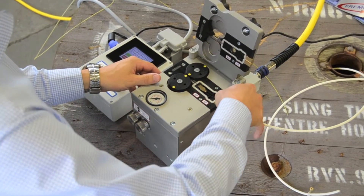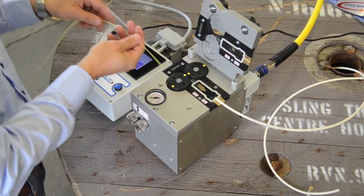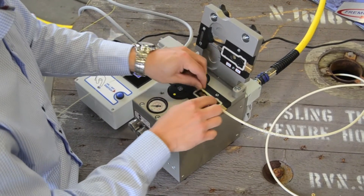Place the micro-duct in the adapter set. Please be sure the micro-duct is set firmly inside the gasket for a perfect sealing. Place the fiber cable into the groove of the adapter plate and lead it into the micro-duct.